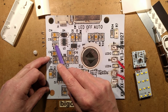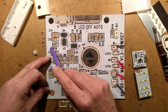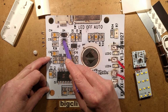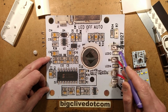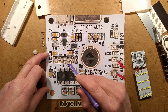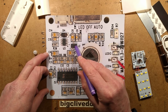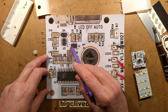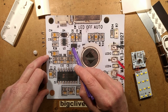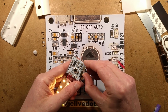And then we've got the 4,720 ohm resistor here, which I'm guessing is tied into this and will set the charge current for charging the lithium cell over here. This 662K is a 3.3 volt regulator. It's one of a range with slightly different numbers. And this is purely an identifier number, it's not the name of the actual component. But the 662K is the 3.3 volt version, and I've tested this and I can actually demonstrate this.